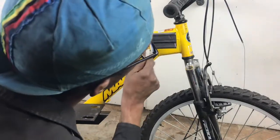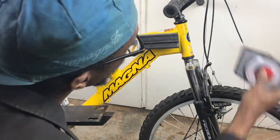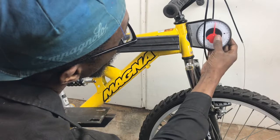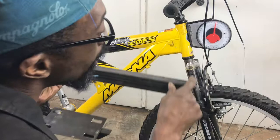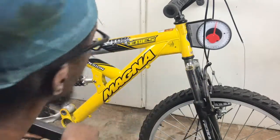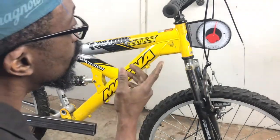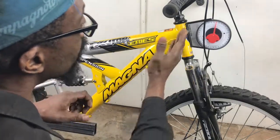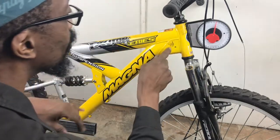Today I'm going to get this mounted up to the headset. The first thing I need to do is figure out the angle, and the angle is 70 degrees. I'm going to have to lop this off at 70 degrees and fish-mouth this to fit around the round tubing. I'm going to show you some tips and techniques that are going to help you do something like this a lot easier when it comes to fabrication, good fitment, and finding out complex angles.